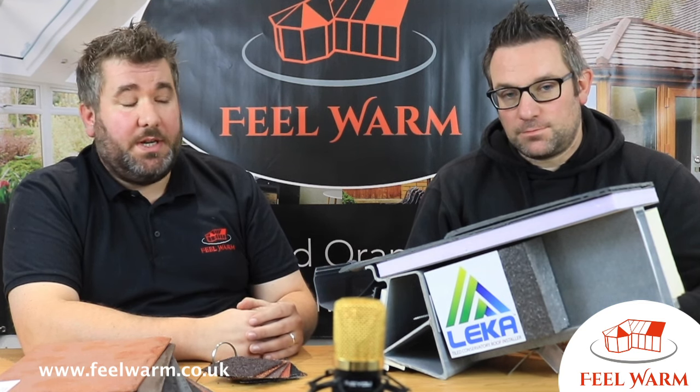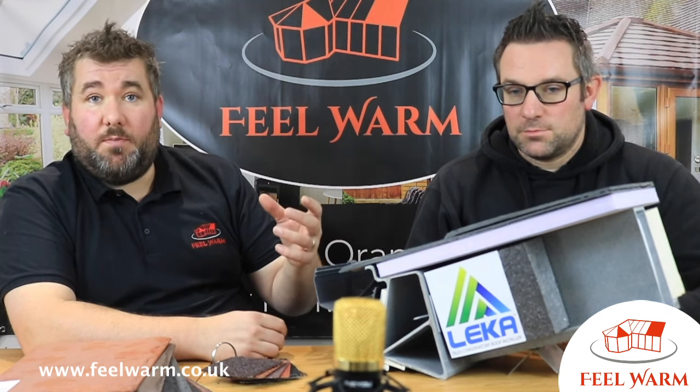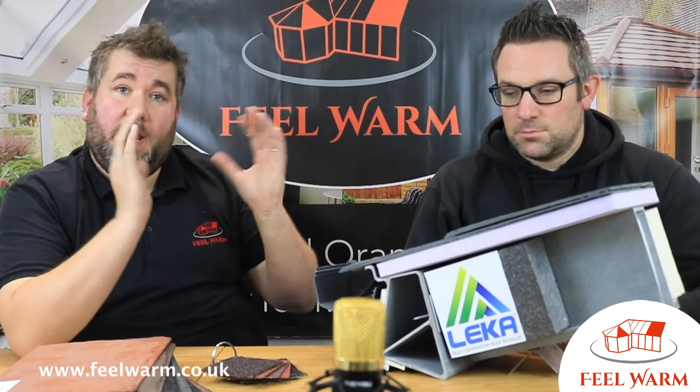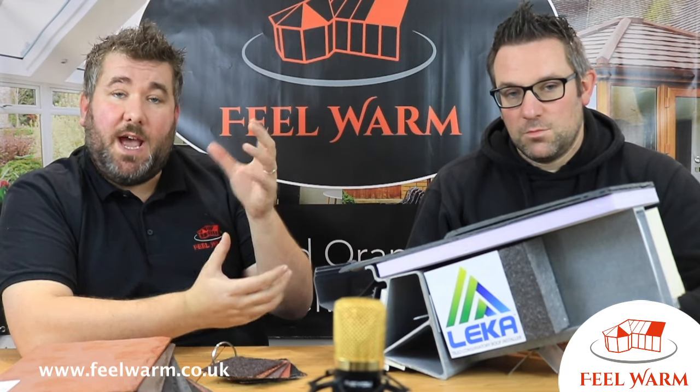And we worked with third-party log burner installation companies to get those installed. The main thing that you need to absolutely ensure happens is that when you're getting a quote for your log burner to be installed, you are getting a twin wall pipe being installed that goes through the roofing cavity.